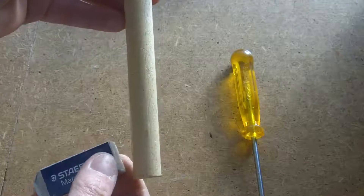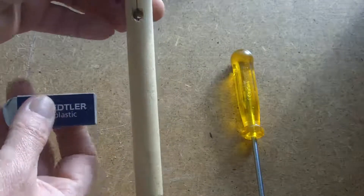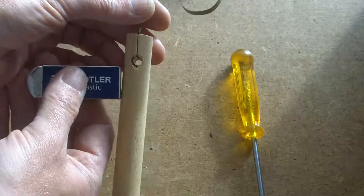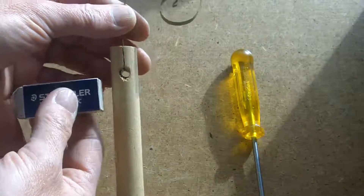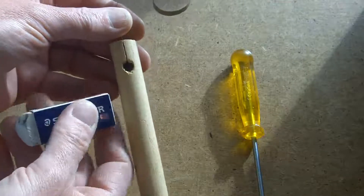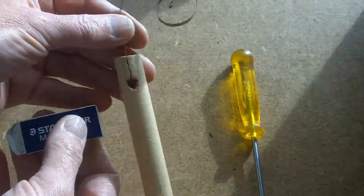So I want to keep the air gap small. Given that I've got a three or four inch swing, it could be that I arrange the timing so it fires right at the end of the swing. But I know that the gap created at the top is very small, so if I put the magnet at the top, I'm always working with a small air gap, and that has got to be good. Having a small air gap is good because the electromagnetic force is subject to an inverse square rule — if you double the distance, you quarter the power. So the closer I can get it, the more powerful the magnet acts upon the pendulum, and that in turn will save battery power.